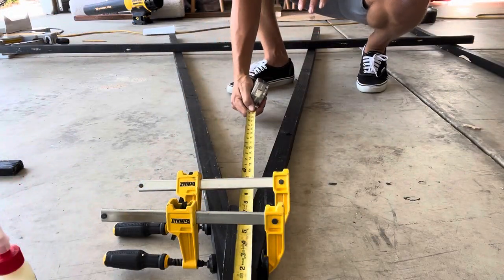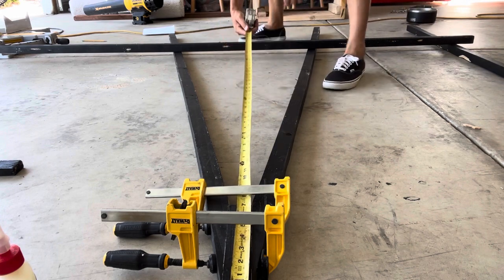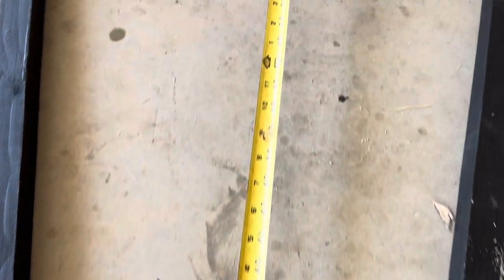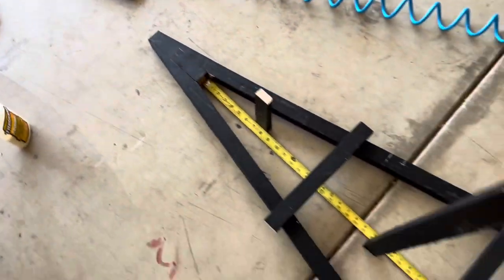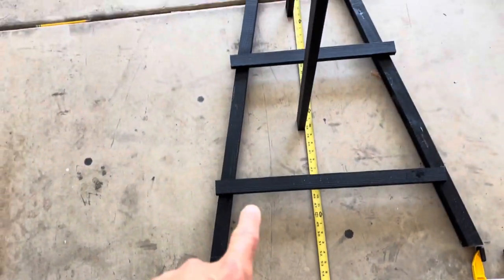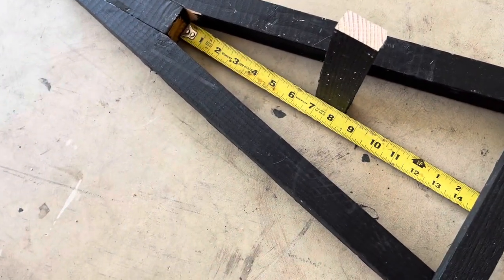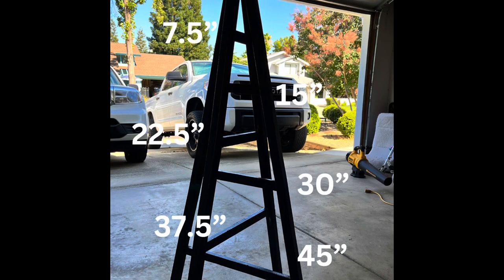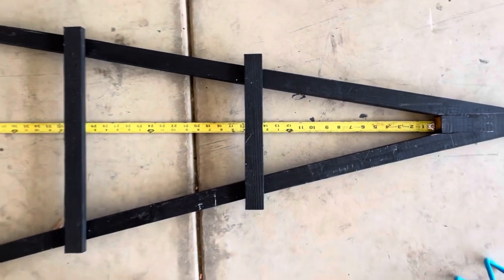Now's a great time to figure out how tall we want this obelisk to be. I want mine to be 5 feet tall, so we need to measure from the top and go straight down to 5 feet. We're going to use one of our other legs to mark that 5 feet, then scribe a straight line across the bottom and cut the bottom of the legs. I then had to figure out how I wanted these cross members to be spaced — the first one at 7 and 1/2 inches, then 15 inches, and each one down the line is 7 and 1/2 inches on center from the one above or below it.